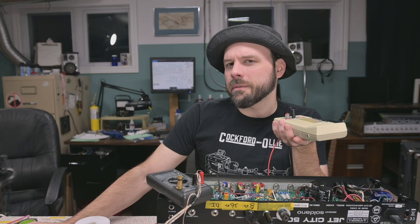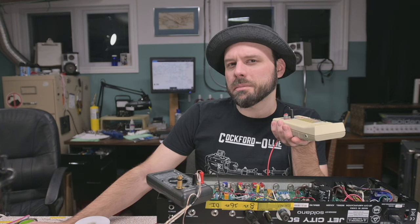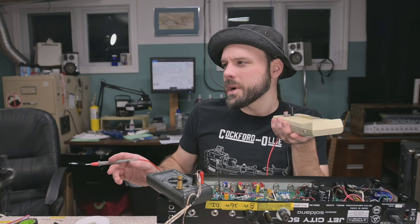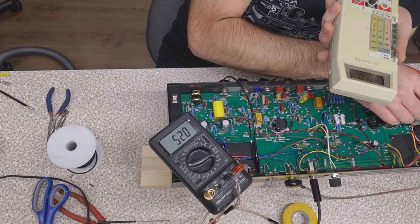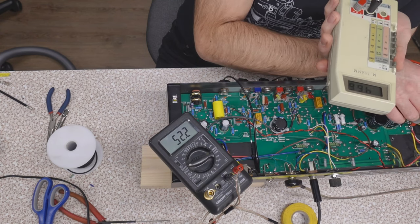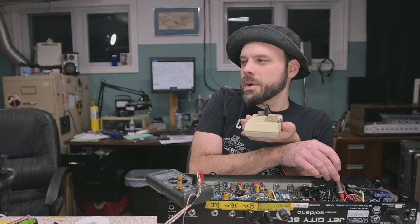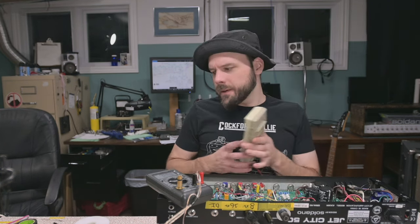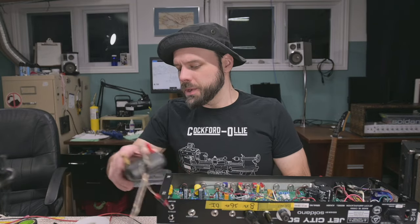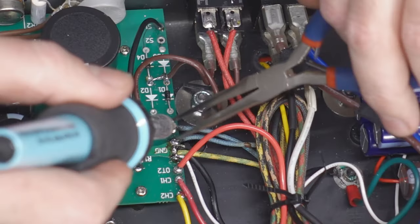It sounded great at 460, which makes me feel like I need more voltage drop on the preamp, not less. So if it starts at 497 on the B+, we have 365 on the B+. Okay, under load, we're back where we were. We only get 1 volt drop across our choke. It's probably not much of a choke, but at any rate, we need to fix this bias supply, get proper tubes in there, and then see what happens.